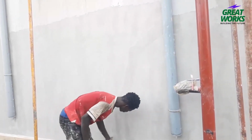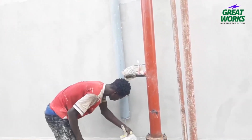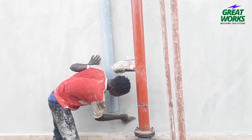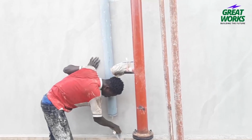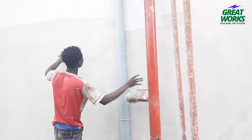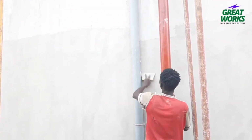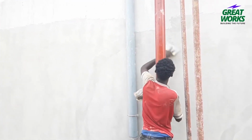1. Widen the crack. Use a hammer and chisel to widen the crack to about half inch deep and wide. 2. Clean the area. Remove any loose debris or dirt from around the crack. 3. Apply the concrete patching compound. Use a trowel to apply concrete patching compound to the crack. Make sure to fill the crack completely and slightly mound the compound over the crack.